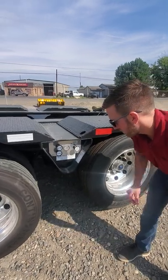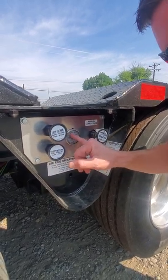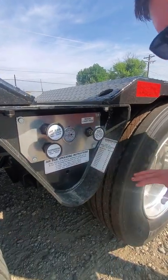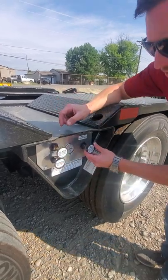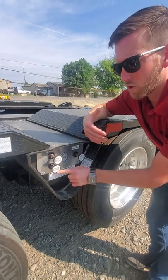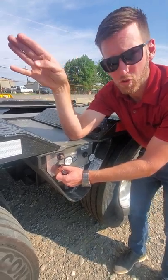The ride height controls at the rear are pretty straightforward — all the instructions are here. You've got a liquid gauge that tells you what your load on the trailer is. For example, if you're at 60 PSI with all three axles down, you check your chart here — that's 19,000 pounds per axle on the trailer grouping. When you're going down the road in transport, you need to have your suspension control pushed in in the auto configuration. If you get to a railroad track or crossing where you're afraid you're going to belly out and need to raise the trailer, you can raise it off the transport locks on the gooseneck to raise the front up for slow maneuvering only.